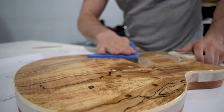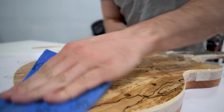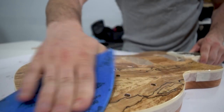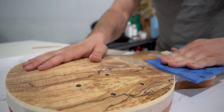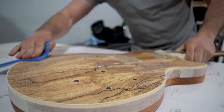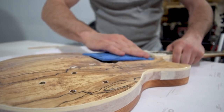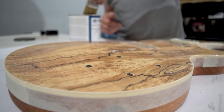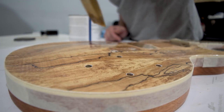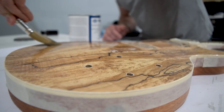So this is what it looks like after the first one. And here I am with some 800 grit sanding once again. I'm trying to avoid using my fingers as much as possible. I use them for that rounded area, the indent around the outside of the carve. I can't use a block on this because it's not a flat surface, but as much as possible you want to use your palm or use your fingers in conjunction with one another to avoid putting grooves in it. You'll notice that I'm sanding a little harder this time — I don't have to worry so much about going through my thin oil finish because I've got a nicer, thicker buildup here coming from this urethane. So I can actually sand this pretty aggressively, make sure I get it nice and smooth, and go back in with my varnish once again and add another coat.